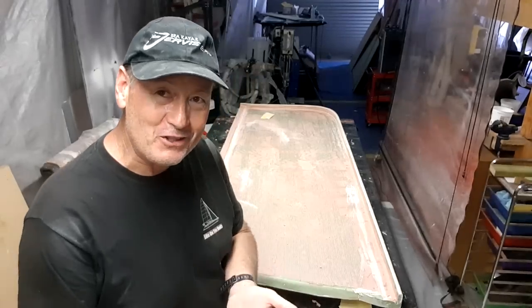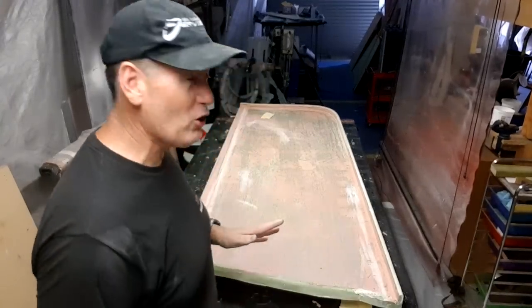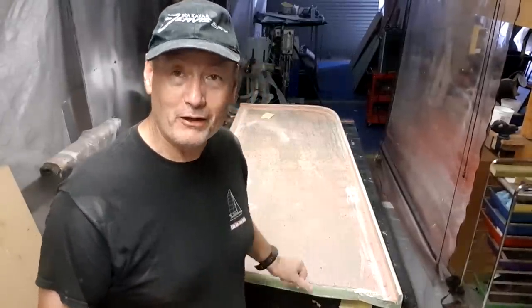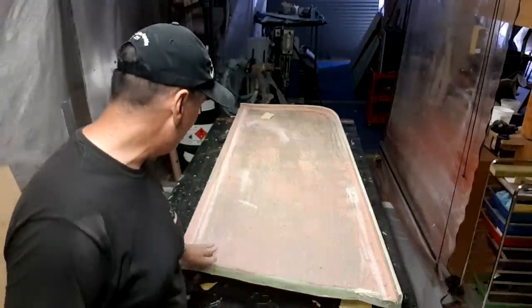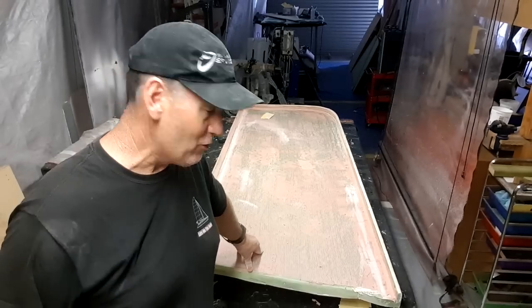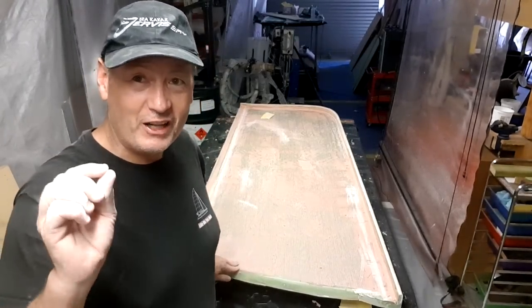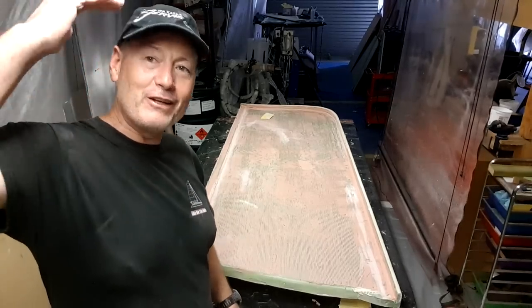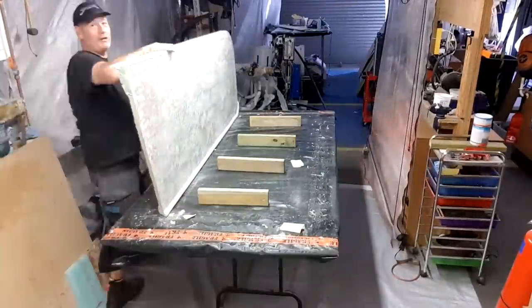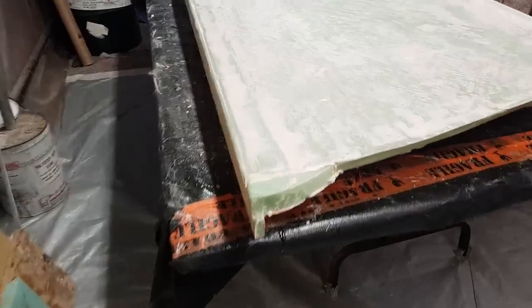We basically started to sand this morning just to take off some of the rough edges. Your sandpaper will fill up with resin if it's uncured, so anything under 48 to 72 hours when using polyester, vinyl esters, or epoxies is going to fill your sandpaper - you're basically throwing money down the drain. Sometimes you're better off to let it sit for a couple of days. Because we used peel ply to lay up all these components, we can simply fair and sand back the fair surface. Not a lot of fill required here because it had quite a wavy surface due to using quadraxial, which is quite an aggressive heavy weave. We're aiming for a reasonably fair surface so that the underside is reasonably smooth.